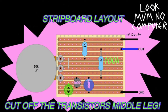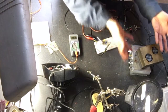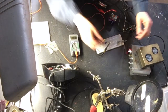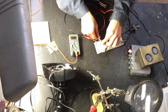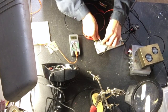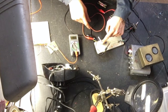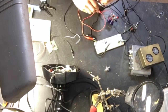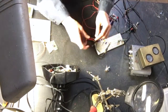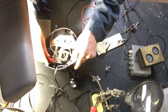I copied this little oscillator from Look Mom No Computer, so let's hook it up. Turn it on and here we have it coming out of our tiny speaker. Now I can change the resistance with this little pot right here. The idea is instead of using the regular twisting potentiometer, I will use the potentiometer that's inside the joystick. Different potentiometers have different amounts and I really don't know what I need, so we're just gonna hook it up and see if it works.